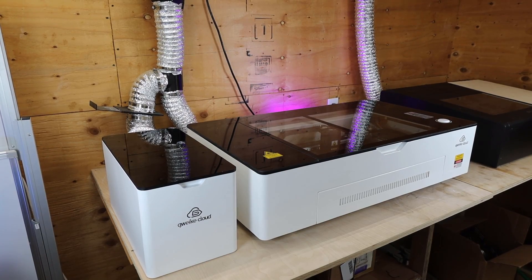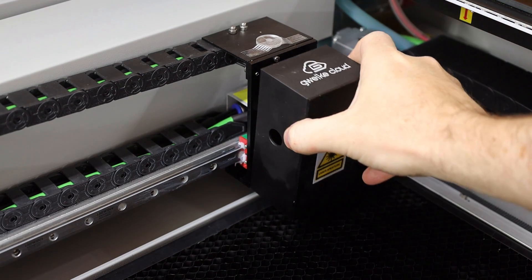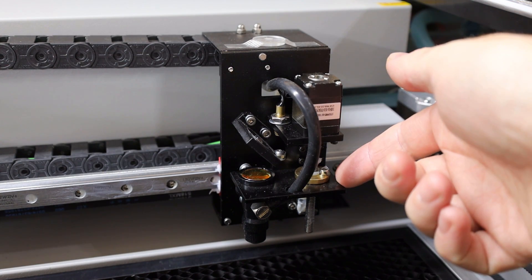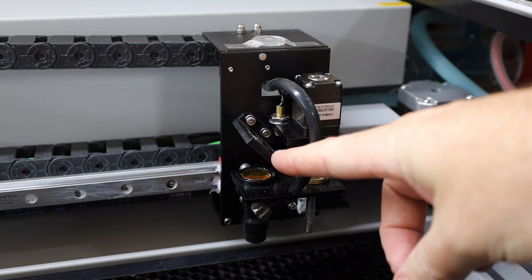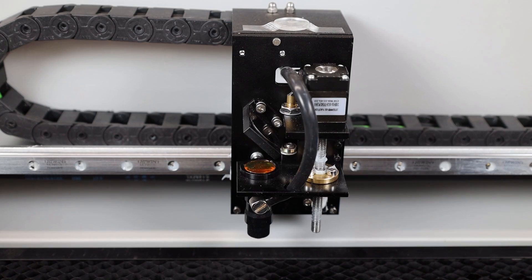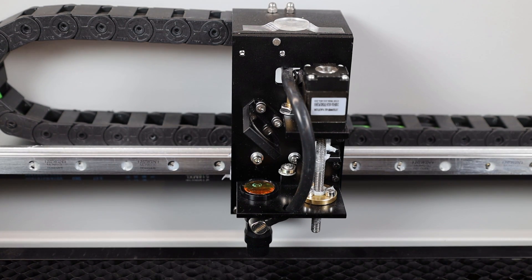With everything all set up and plugged in, let's turn it on. As you can tell, it's kind of loud when you turn it on — that's all the air pump. Let's check out the laser head itself underneath this magnetic cover. You can move the focus up and down with this little motor, and this rubber hose next to it is the air assist line. Right here is a mirror that will redirect your laser into the lens and then out into your piece. As you can see, this moves quite a bit, so you're going to be able to use this on multiple size materials with no problem.